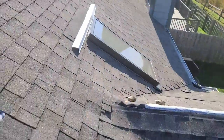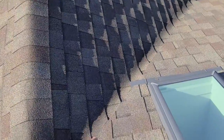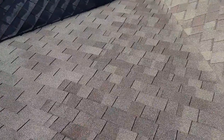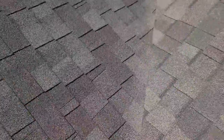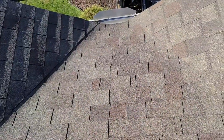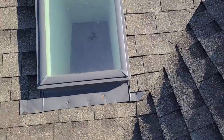Let me show you guys how they did theirs over here. You see, they did their valley like I did my other side over there — I'll show that to you in a second. But this is the way it should look. Because this water, when it comes, it's not going to hit this and try to run up very high. This is a 6. It's going to hit this and come back down. It's going to try to walk on this 4/12 like I said it would. So this is the correct way to do it.